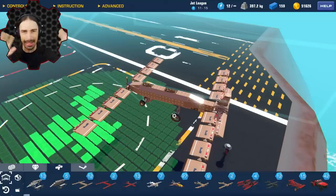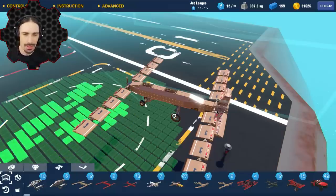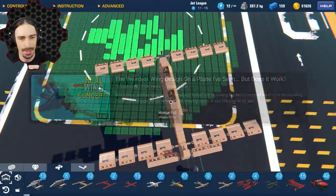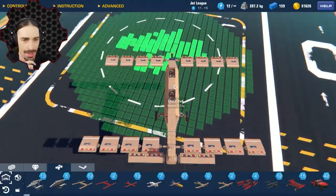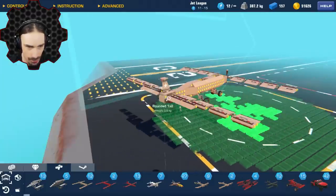If I do an S-bend where the left goes forward and the right goes back, I think that should give me roll — but wait, that might actually cancel out. I've done a swept wing plane before where the wing rotates to an angle. The solution is I have to have one side go forward and the other side do nothing. So I'm going to get rid of all the controls for pitch and rethink this.